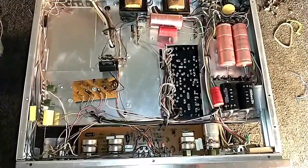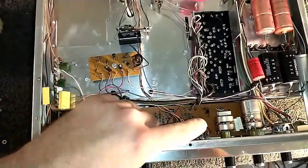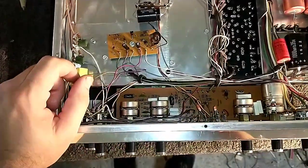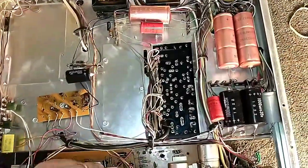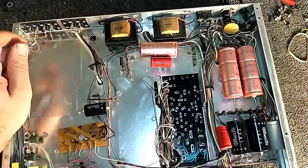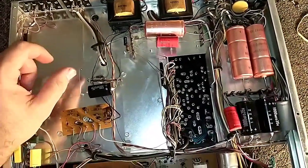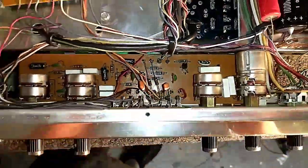With the bottom off we see lots of power supply and output capacitors. This thing here is likely a muting circuit or an automatic switcher for the stereo-matic. This is your preamp board. The way these are designed, it basically comes in from the input selector, goes through an amplified tone network, and then finally your output is your volume. These are very likely your output capacitors, here's more filtering for your power supply, and here's your main power supplies. And then you've got these two transformers which are your inter-stage amplifier driver transformers. Interestingly there's another potentiometer with a non-adjustable wiper - I've never seen pots like that.